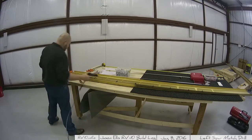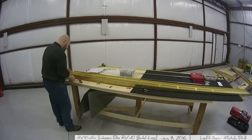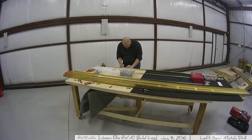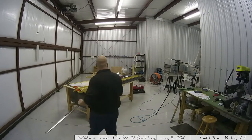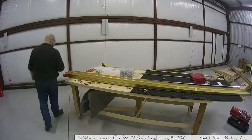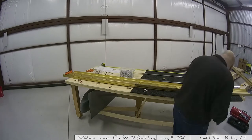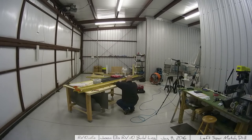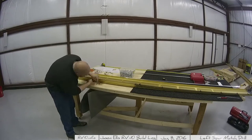There — that was the wrong hole I just drilled. I'm not satisfied with it, this can't be right. I finally realized what was wrong, pulled all the clamps off, and started over again. This is also where I noticed it was a quarter inch too long. By the way, those Cleco clamps are handy as hell. I have 10 of the half-inch and 10 of the inch ones, and I've used them both equally. I think 10 and 10 is probably exactly the right number — they're on the suggested inventory list from Vans and they're quite handy.